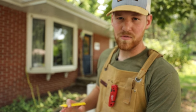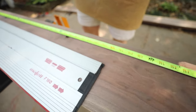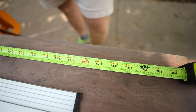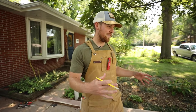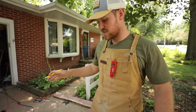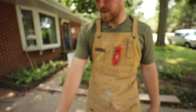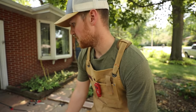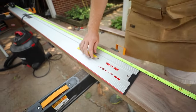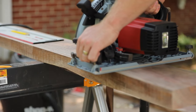The final dimensions of this table are four foot by ten foot. This board here is basically 11 and a half feet, so I only need it to be 10 foot but I'm not cutting it straight to 10 yet — I'm cutting it to 123 inches so that I have some extra room to play with. Once I have it all joined up I'll cut fresh sides with the saw. I'm leaving a couple inches here and gonna make my first cut of 123. The track is just a little over 124 inches so there's plenty of room for that saw to stay on.